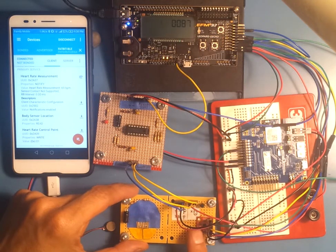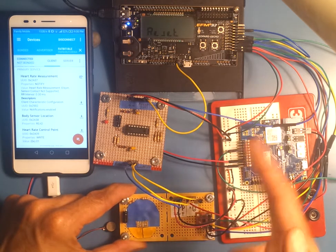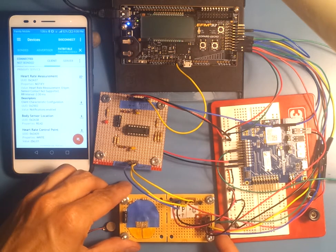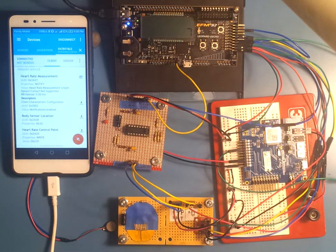There's an accelerometer on here that's programmed so that if you tap it twice, it'll reset and say, okay, shuts the lights off. And that starts this timer here, basically, that says you need to move within this long. And it's also got a sensor. If you lift up the edge of the board, it'll wake up the display and turn that on. So we're using the accelerometer for that.